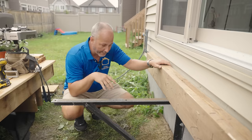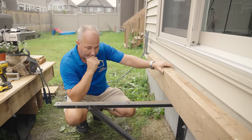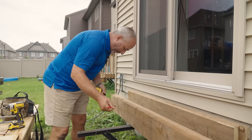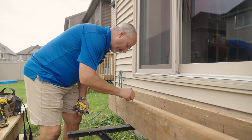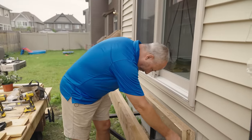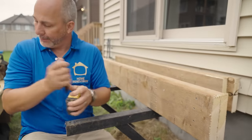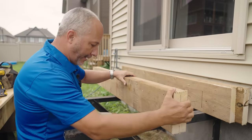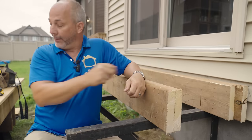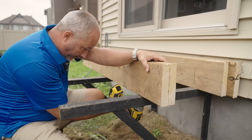Now, this is temporary. We also have a leveling issue. And I don't know, because it teeters, Matt, if I can do the leveling now or if I gotta do it later. So I'm just marking 3/4 off the center of that hole, because wood is 1.5 inches wide and I want to center that hole on this beam here, right? So by putting that there, and then hopefully 7 1/4, come over here, put my 7 1/4 mark. We'll line those two up and put a bolt in there. Now this is somewhat temporary because I am planning on coming back on this all later on and then squaring off this box. But you can see I can't build anything in as it's tipping over. So, gotta keep her from tipping over. There we go.